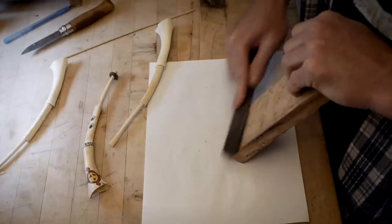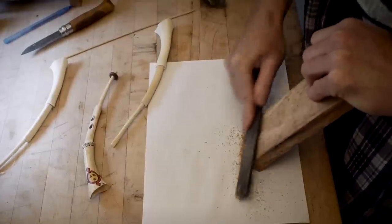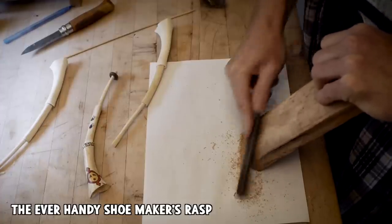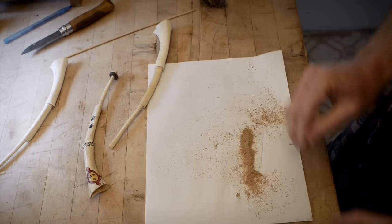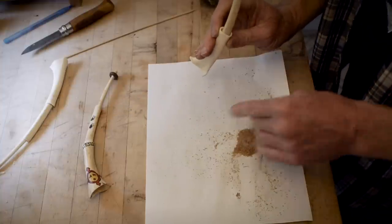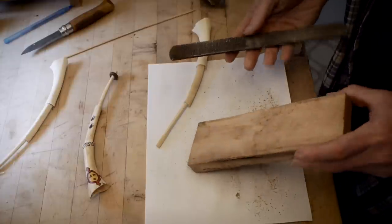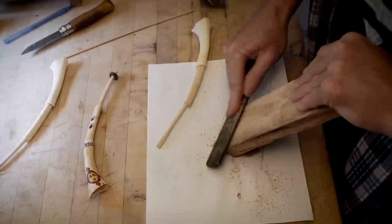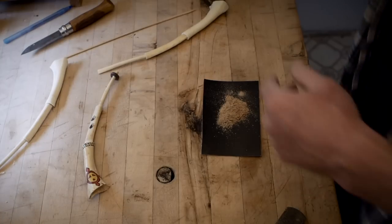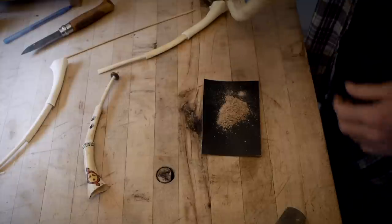So I'm going to make some wood flour. I think the rasp side of this is good - we'll mix it up and make a little bit of fine powder, more like wood flour. What does this do? It provides a filler so that the space we're filling is a bunch of wood with a small amount of glue. If we mix it well, the glue should be touching every surface of every piece of wood flour, and therefore the glue will shrink but the wood won't shrink, at least not much. Today I'm going to use regular carpenter's glue because I know everybody can get this.